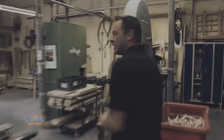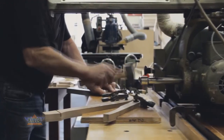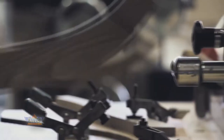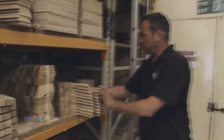Welcome to the wood mill. This is where every single component of the famous Morgan ash frame begins. Each one is marked out from a template and roughly cut out before a more accurate finish is achieved on the spindle moulder. The joints and trenches are then routed out. The finished components come out of the mill and are put onto this rack ready for sub-assembly in the detail area.